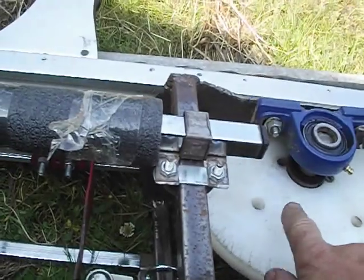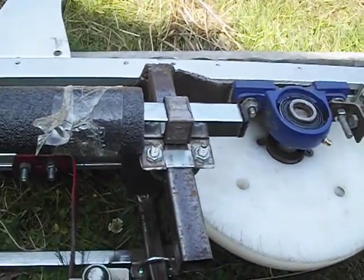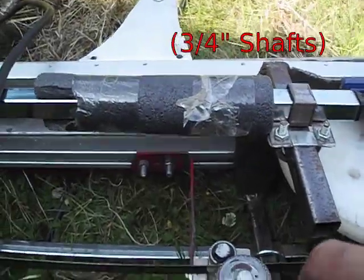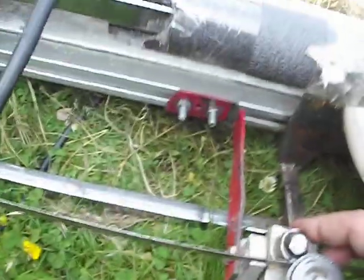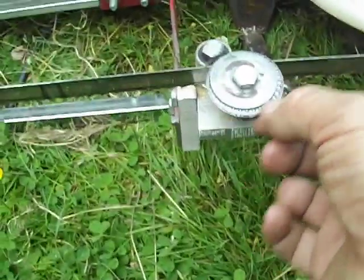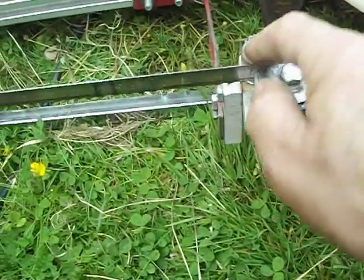Pillow block bearings. Those are H compression fitting couplings — you could use anything like weld-on hubs. This is three-quarter inch. There are some bearings made for rolling, and that's what I've got for the band. Above that I have a plain regular bearing, and below that there are end bearings and washers. There's a washer on the inside that goes against the band, and the washer on the outside keeps the thrust bearing from coming off — one of those on each side.